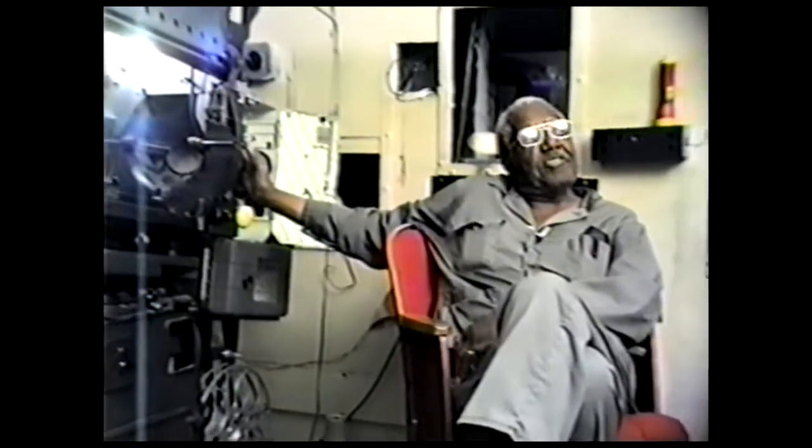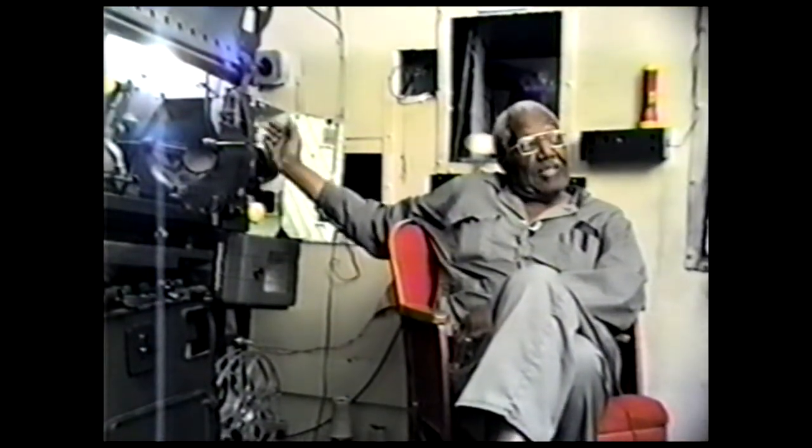How do these projectors switch from reel to reel? Oh, they got a little dot up in the upper right-hand corner, and that's my job. Is that what those are for? That's my cue mark. When the first one you see up there, I'm supposed to be looking for that dot. And then I start the idle projector running. And it's running, and I open this lamp house, and the light's going down to right here, and then it stops. There's a little dowser that keeps that light from shining on the film. When that second cue mark comes, I punch some buttons over there, and a dowser raises this dowser and closes that at the same time. And I take care of the sound, and that's the name of the game.